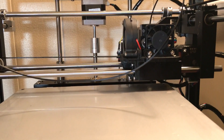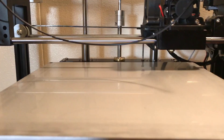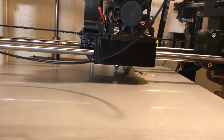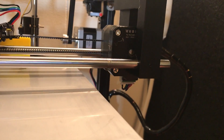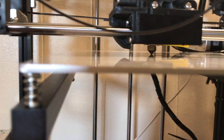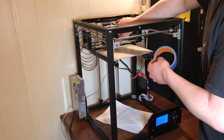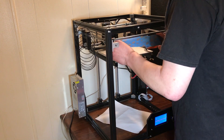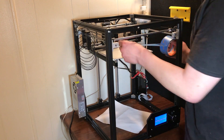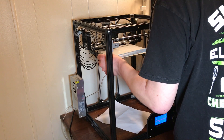Here it's going for a print right on the aluminum — I should have some tape on there but oh well. Another thing that happened is that this black wire pulled out of this stepper motor over here, and that was a bit of a pain. I had to pull the connector out and recrimp it. There's a nice convenient little reset button on the Arduino board. Also, you can't really push the nozzle completely out of the way of the bed — I really wish you could.